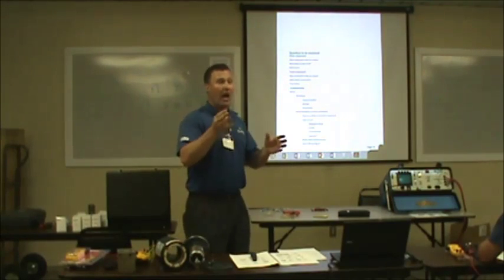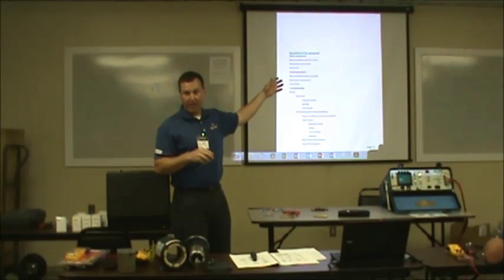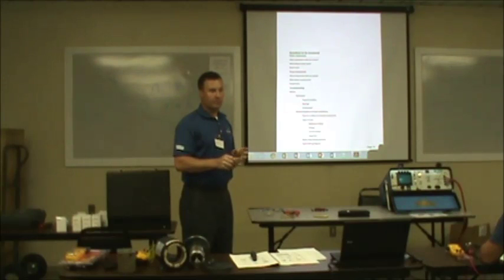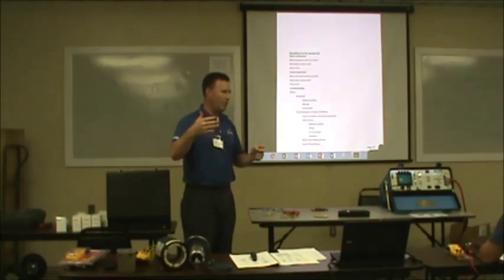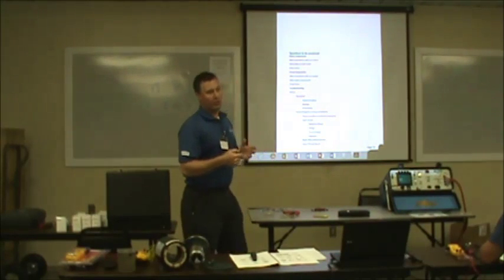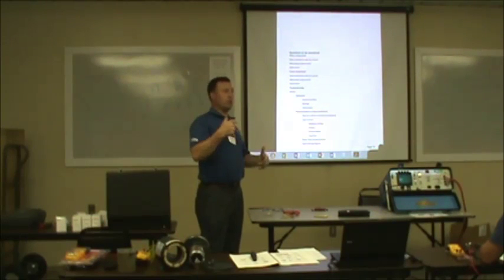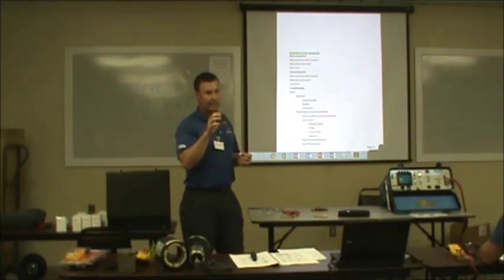But as far as I'm concerned, let me tell y'all about something I did about a year ago over here at CEA, Capeland Environmental. I don't know if any of y'all know those guys, but they have a 150 horsepower motor on a blower, and we repaired that. They've had all sorts of trouble, even under warranty with this motor. The motor failed, they sent it into the shop, and we rewound it. We sent it back, and the bearing temperature was running hot.